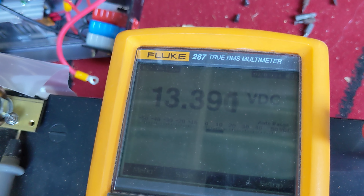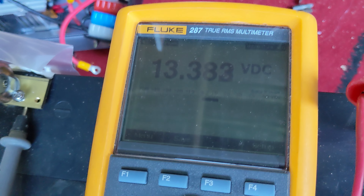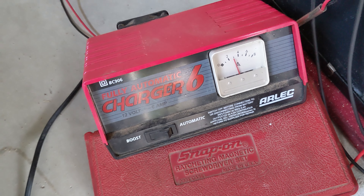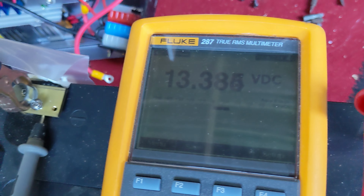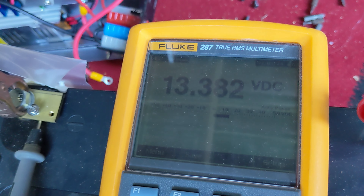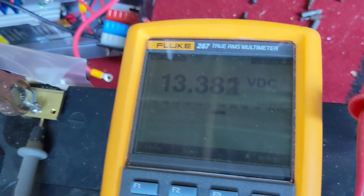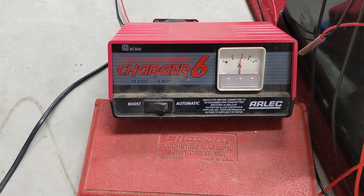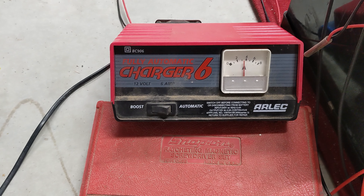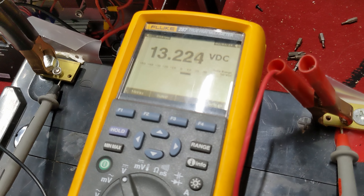Back now about three hours later from the last check — it's at three amps now, so it's definitely putting the power in. Interestingly, as you saw originally, it's working its way down to a more stable voltage as it gets control. It's now 13.3 volts, which is actually a good comfortable voltage. We're not frying the battery — we're pretty much getting up into the 14s when you properly charge. At 13.3 we're still good. What you want to avoid is frying the battery — you don't want it bubbling and evaporating the liquid in the gel.